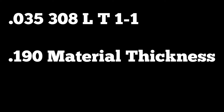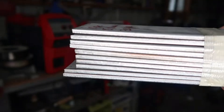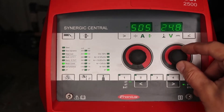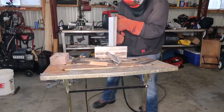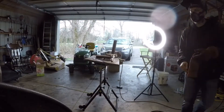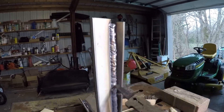This weld test is the same power but running out-of-position — a vertical-up fillet weld. Since I'm out of position I bumped wire feed speed down to about 520 inches per minute at 24.9 volts. The best part about dual shield flux core is you really don't need much oscillation — just a straight-on position with maybe a 15-degree push angle. You can run it straight uphill with no weave pattern and it ties right in. No problems.